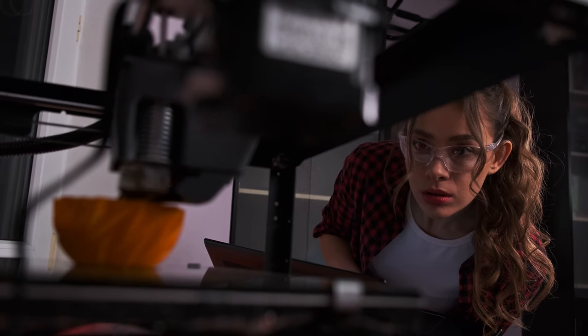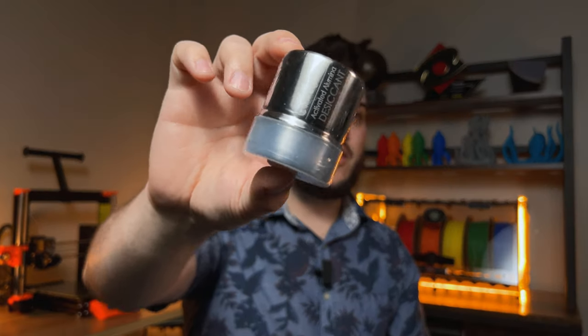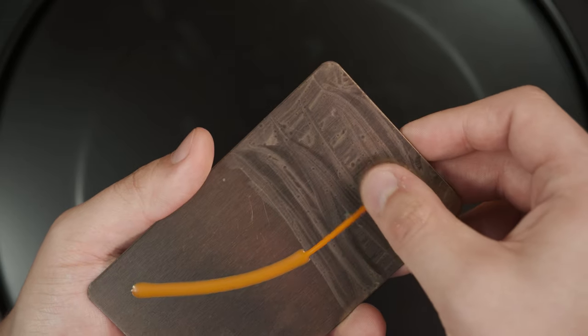On some rare occasions, customers approach us saying they're still getting plastic buildup on their nozzle. For cases where it isn't working, there are a few things to check that usually solve the problem right away: bed adhesion, distance from the bed, printing at the correct temperature, and if all else fails, check that the filament is dry. We have a filament drying desiccant — we'll leave a link in the description. In cases where certain filaments still stick, removing them will be much easier because of the plastic repellent paint — even with really nasty filaments. For the vast majority of filaments the average user prints, PRP is going to work like a charm.